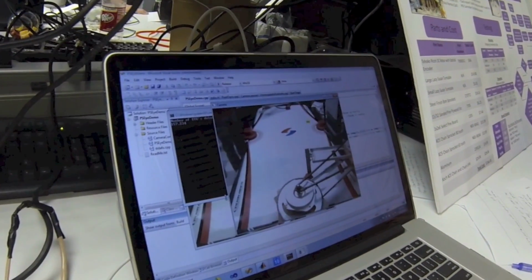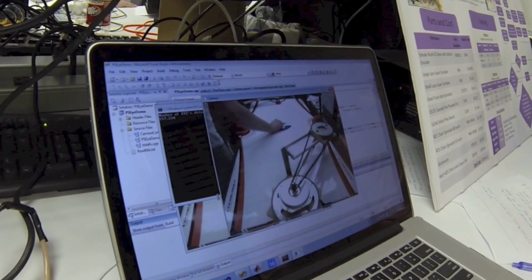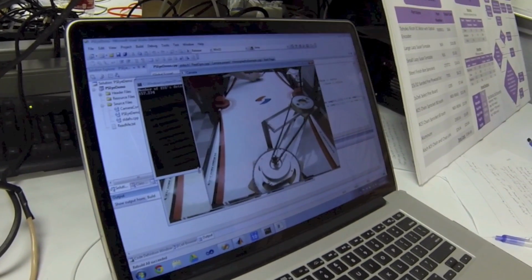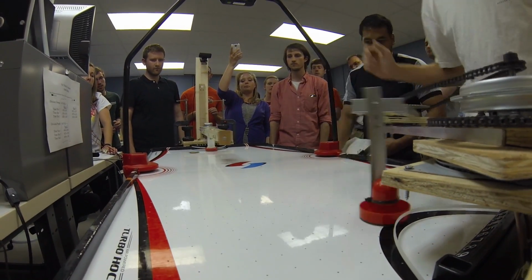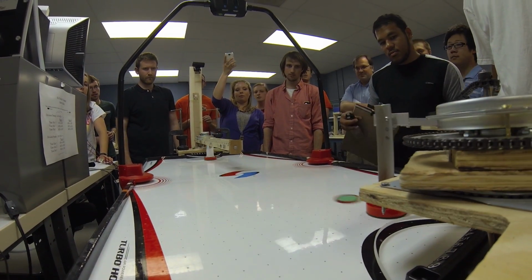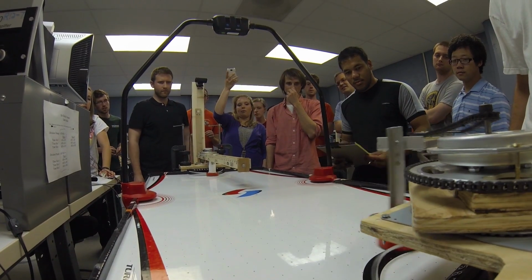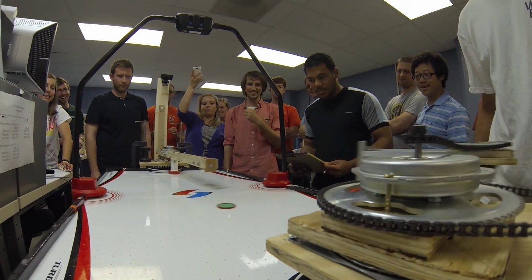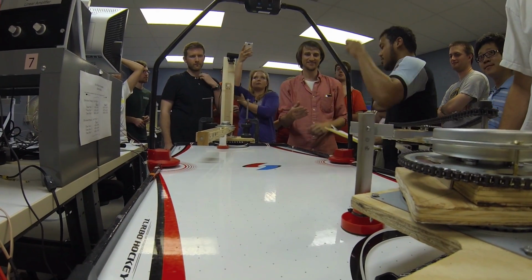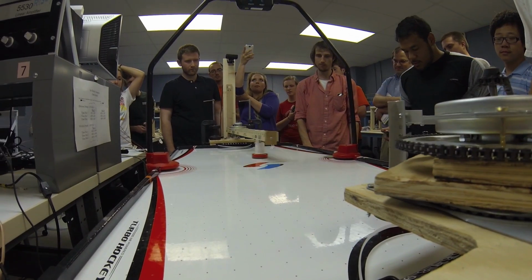Here you can see the live output of the camera. Many pieces of processing are going on here within the OpenCV library in C++. Each frame is instantaneously being processed using filtering, dilation and erosion to only focus on the green content and remove any noise. Doing so allows the puck only to be seen. Since the camera is mounted on an angle to the air hockey table, we had to use homography to convert the skewed image into a proper rectangle, giving us exact pixel locations of the puck, and that's how the motors can in turn move to that puck position.